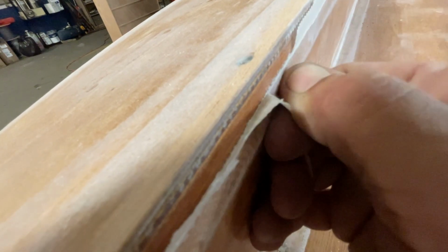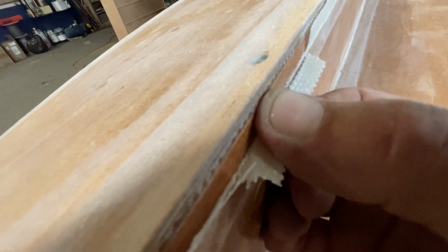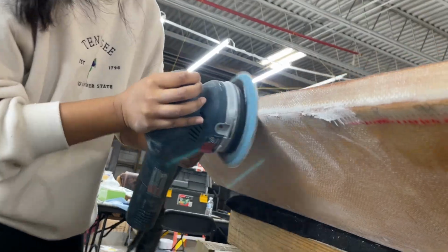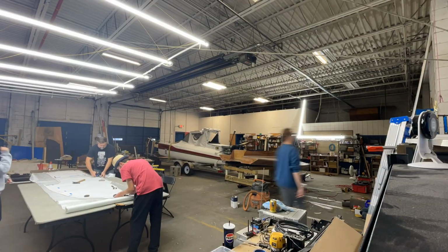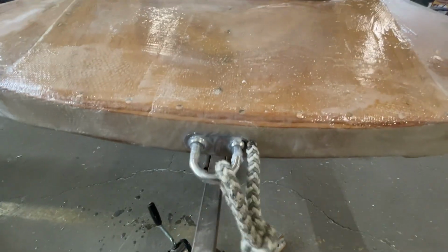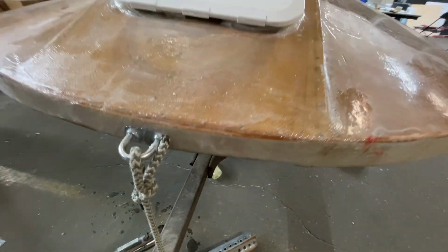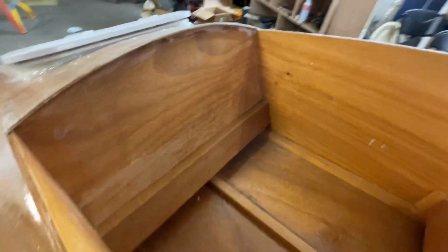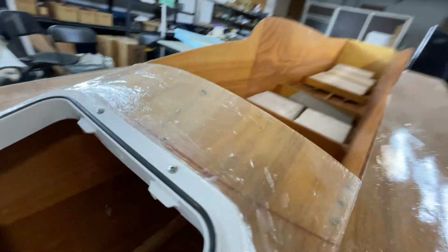and we first needed to take a step back by removing the inadequate fiberglass tape from the seams before we could finish fairing the wood and then reinforcing the hull with a 9-ounce layer of fiberglass. While we were at it, we added a tow point to make it compliant with PEP rules. After a few weeks of glassing and fairing the hull, we installed a watertight hatch forward of the cockpit in order to have access to the back side of our dashboard for routing control and power cables.